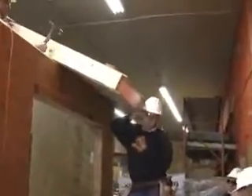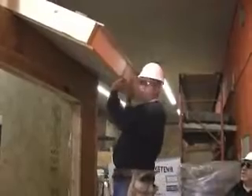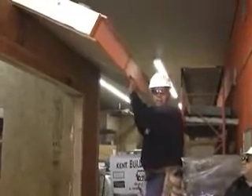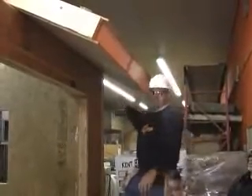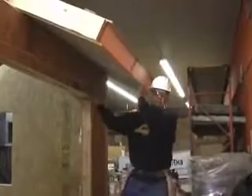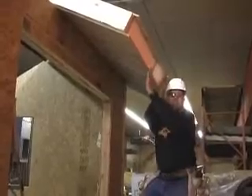When we put this first panel on, we didn't screw it down completely. What happens most commonly is a big long panel will get put on first along the edge and the installer may measure the overhang — whether it's a 6-inch overhang or a 12-inch — at the bottom and at the top, and that's what they'll use to determine the proper set of the panel and screw it down. But in most houses, the rake edge is not the long side of the roof plane. It's typically the front or the eave overhang, so the overhang there is more important. It's also important that the panels stay true to the ridge. If you've got a structure that's a little bit out of square, you don't want to take your first panel, screw it down completely tight, and then put your second panel on and realize something's running askew and you start getting sawtooth in the bottom edge of your panels.